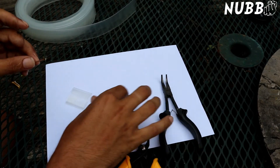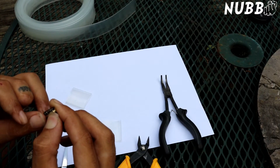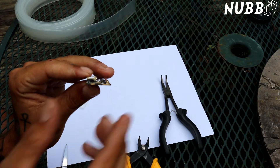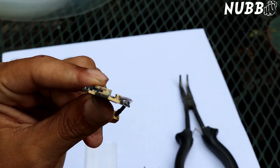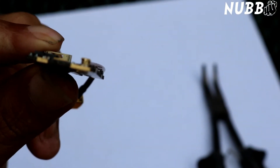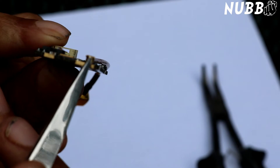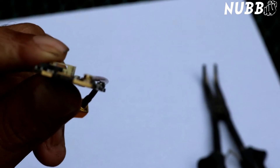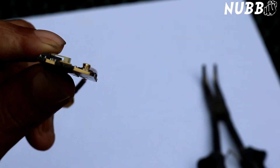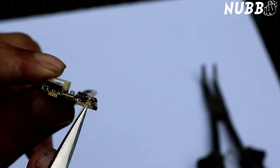Now the second way — I saw Trappy post this on Facebook, I'm not sure if anybody has posted it on YouTube yet. If you take your TBS Unify, right here on the edge of the U.FL, you can solder it down to this larger pad. You can solder the U.FL down to this larger pad, as they're both grounds, and then have your SMA running in this direction.